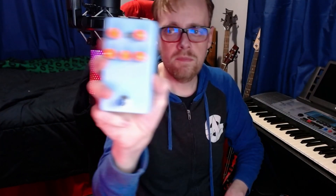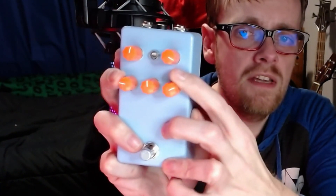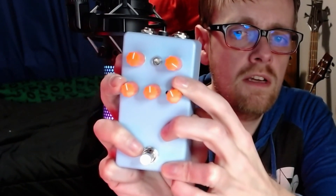I tell you with text on screen where the knobs are at. I did mod this pedal in a previous video and put the internal trim pots on the outside. During all the testing, those two are at 12 o'clock. For those who want to geek out about the HFE settings — which has to do with the voltage that activates the transistor — I wrote the HFE number on each bag the transistors are in, and that's on screen for you to check out.